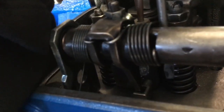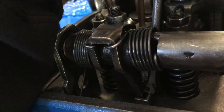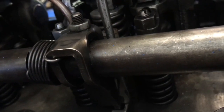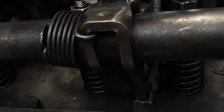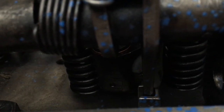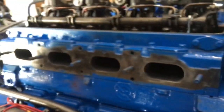And then we check for bounce. See how it bounces back? That means our rack is perfectly set. Now we'll go to the other injectors. We have bounce on that one, bounce on that one, and bounce on that one. So this head is perfectly set.